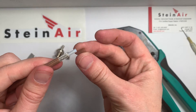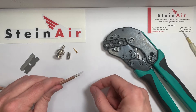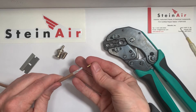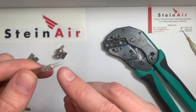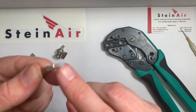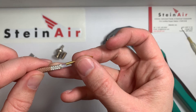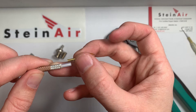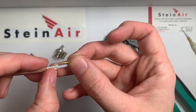I should be able to just scoop that off. Now we just remove the insulation and we're ready to put on our BNC connector. The next step is to put on the pin — the tip of the pin of our BNC connector — and that goes on inside the core of the RG400. We need to strip that to about the depth of this pin, so just look at it and see about how deep it needs to go.